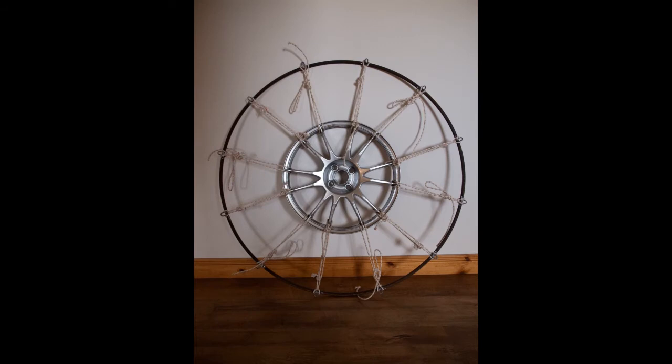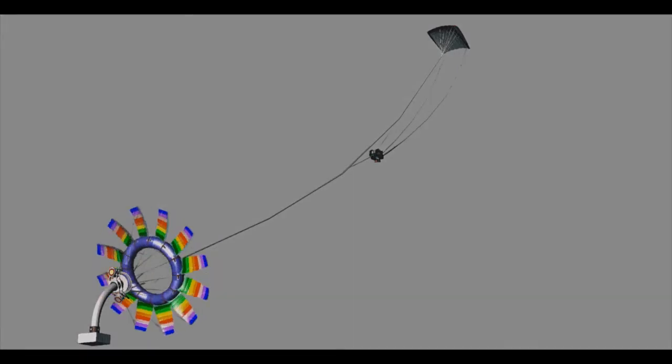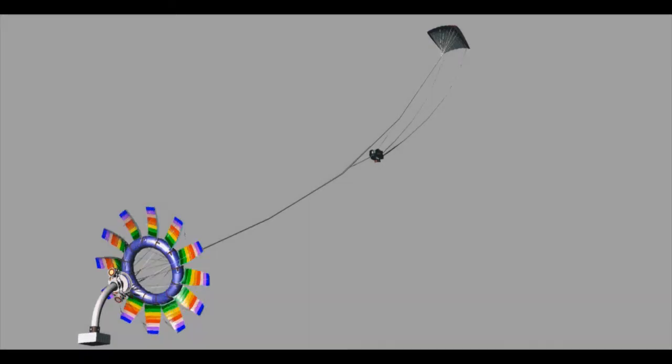The width — the diameter — is very important so that you can avoid twisting. As long as there's torsion tension, here's the top tensioning hub, as long as that's in tension with the lifter kite, you can transmit the torque and the power from the ring rotation back down to the hub which sits upwind of the lifter kite and the ring as it's spinning. So the whole thing becomes materially much more efficient.